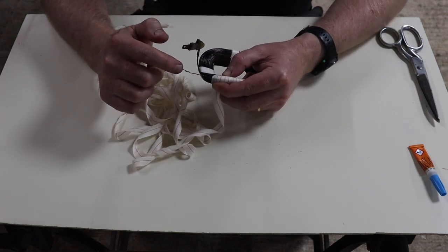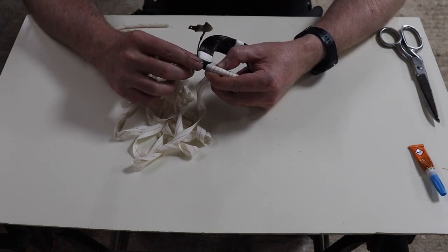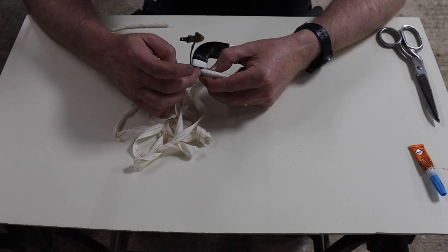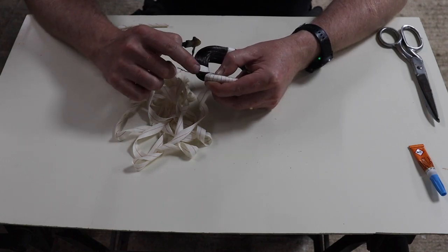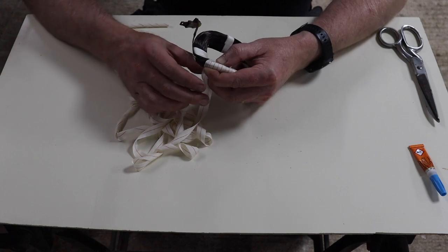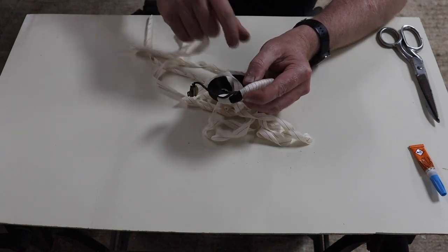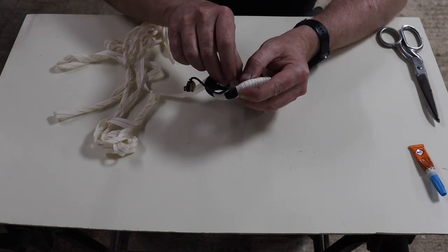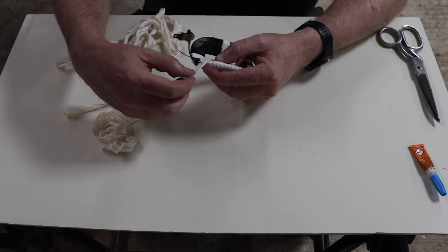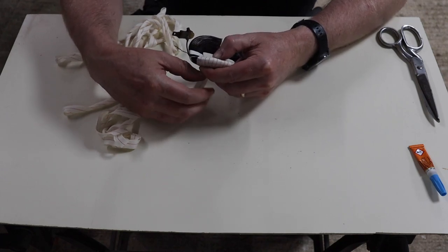Now we're also approaching this little wire, and we need to go. You can see how it was bent there. So obviously it was wrapped up to there, but of course it's not there, right? The other thing I notice is some of the insulation is coming off there. So what I might do is put some of this tape just underneath and then go over so that there's a little bit more protection around that wire as we come out of this corner. So to do that, I just loop it underneath and then tighten it just like that.